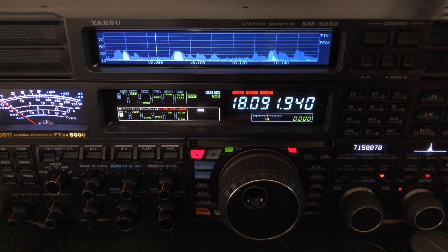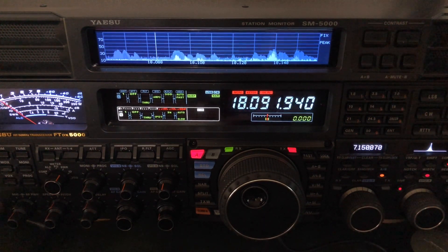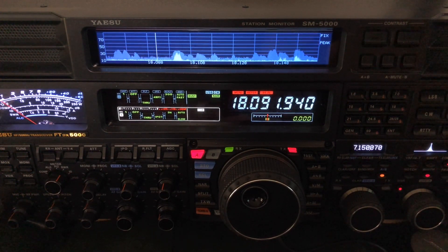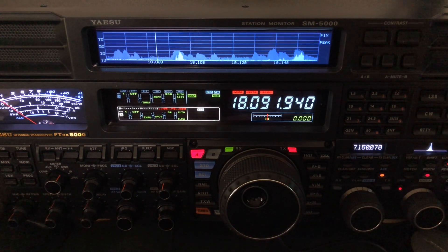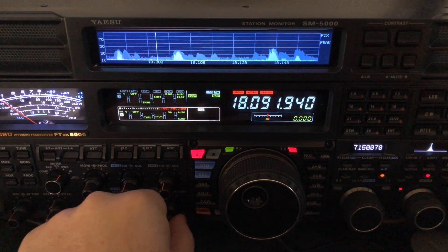With a wide range antenna tuner, that antenna can be used on the other HF bands up through 80 meters. It wouldn't be long enough for 160 meters. My doublet is — it's 250 feet long and I do use it for 160 meters. With that much wire in the air, it is going to normally have more gain than my other antennas on higher frequencies. The problem is, every time you go higher in frequency from what that antenna is cut for, it develops more lobes of gain and therefore some nulls — the lobes get stronger but more narrow. Apparently, the mountain George is on in Colorado falls in a null for my doublet, but for my ZS6BKW it must have fallen into one of its lobes of gain. That's why I'm able to hear George on that.